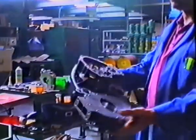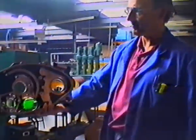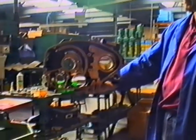This is our £300,000 machining centre. It takes a raw casting like that, which we buy from a company at Coventry. They arrange for it to be painted, it comes to us, and then this machine does all of the machining in 2 settings. We end up with that, which is the right and end plate for an F1. Yeah. And this machine does all of the F1 castings. It does rotor housings for the little drone engine. It does some of the Commander castings.